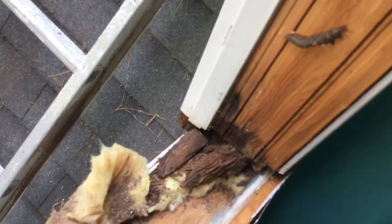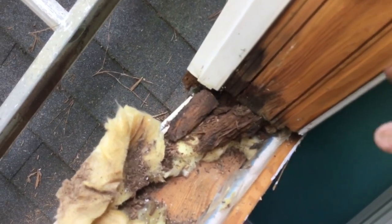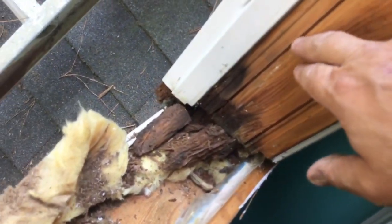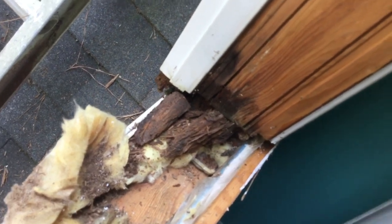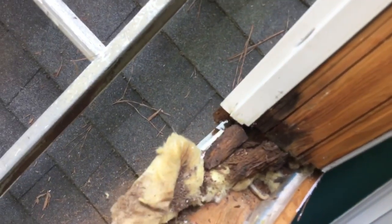There is a left and right side to the jams, so you have to remake it. It's actually real simple on the table saw. You cut the sides, and all you really need is to make these grooves that will slot in there too. All you need to do is cut these little grooves to fit in and attach. Everything else is flat, so you don't really need all this fancy stuff in there.